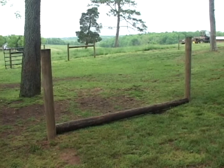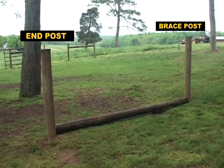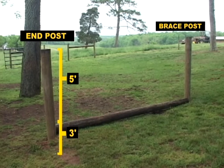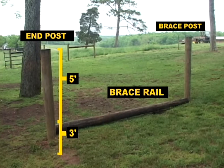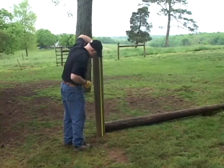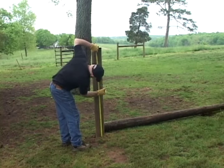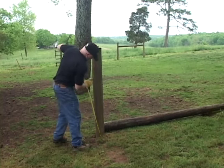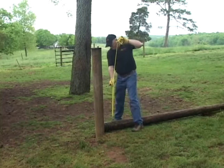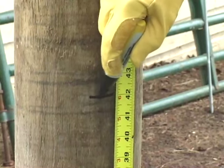Step 1. We begin with one 6-inch in diameter, 8-foot tall post — this is the end post — and one 5-inch in diameter, 8-foot tall post — this is the brace post. A minimum of 3 feet of post should be buried, leaving 5 feet above ground. The brace rail, which we will be installing, is laying on the ground in the middle. We then mark the post for the insulator locations at 48 inches, 36 inches, and 24 inches. These markings should face the inside of the fence.